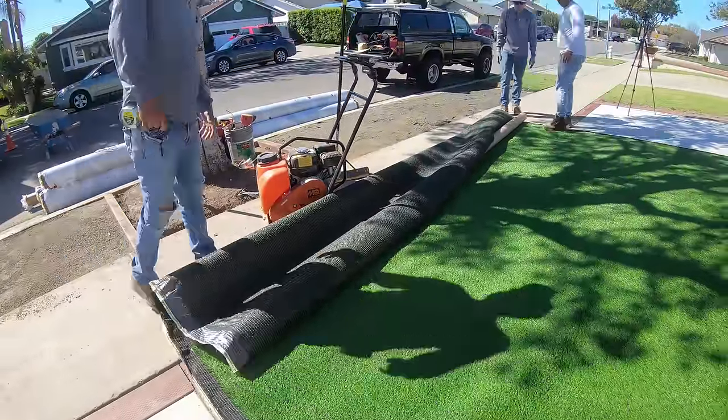So when you are putting nails in on the edges, I would say you want to put them about 6 to 8 inches apart, and then every third, put one right behind them, in between or so. And also, it kind of depends on where you're putting artificial turf, because different climates might affect the artificial turf in different ways due to expansion and contraction. So just be aware of the environment that you're putting your artificial turf in.